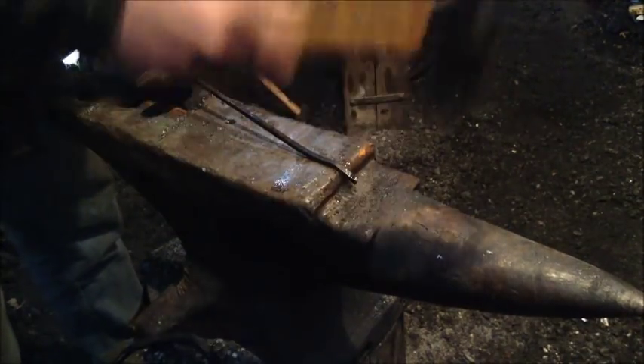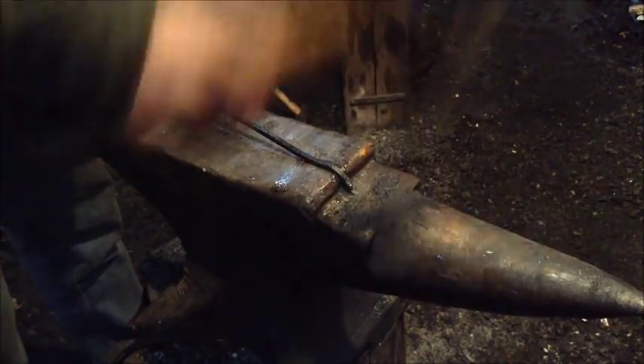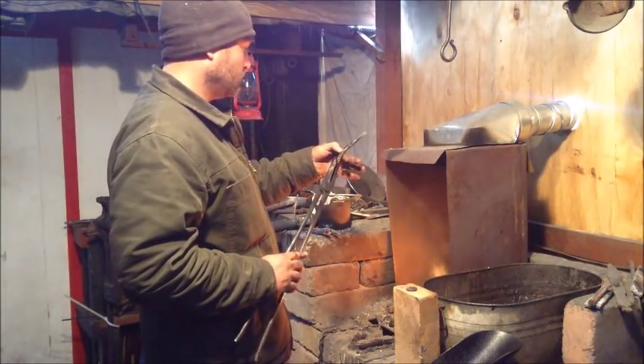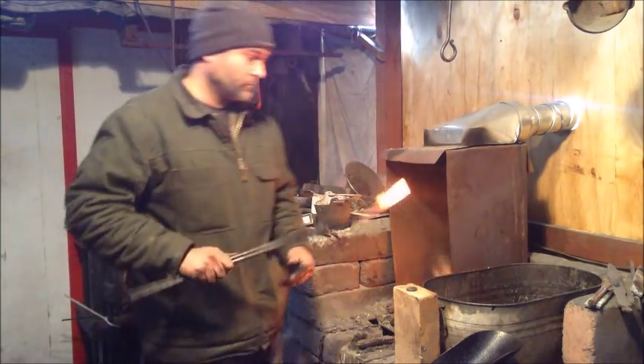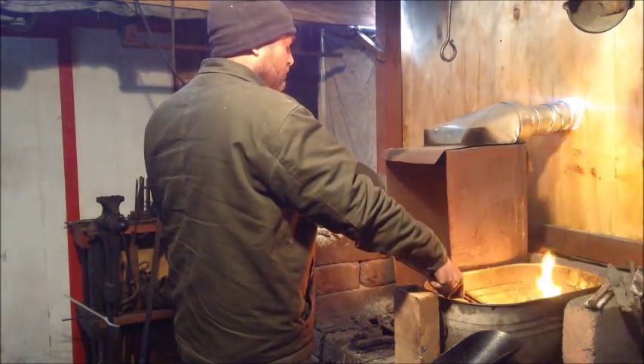Because there's not enough carbon in this steel, it remains plastic and it's able to be deformed under the hammer. The next steel I'm going to use in my demonstration is 4130, which is a chromoly steel. It has about 0.3% carbon, which is almost double the 1018 that we were using, but it's still a very low carbon steel.